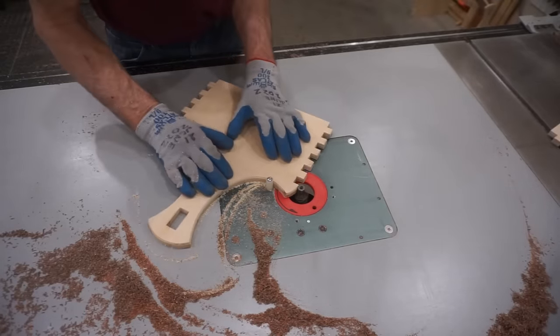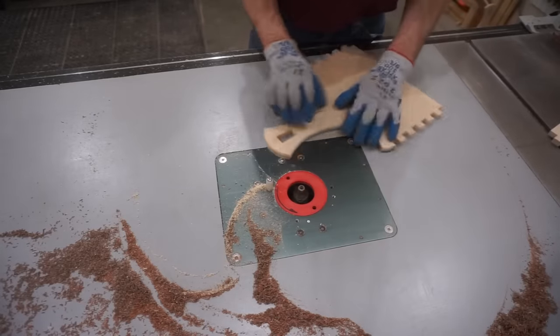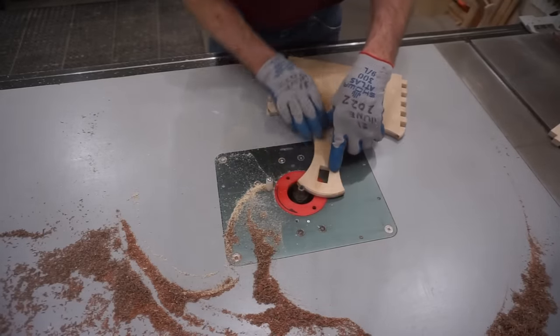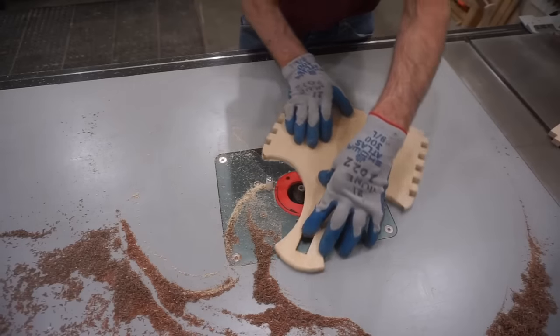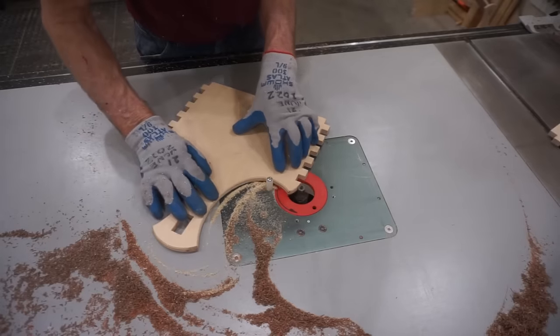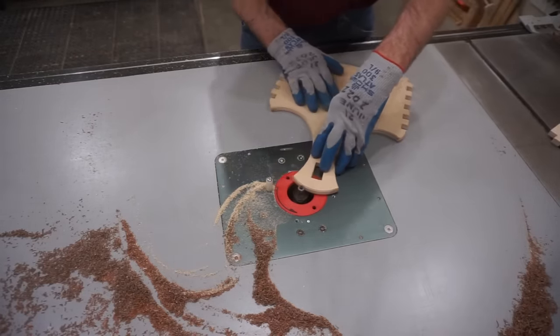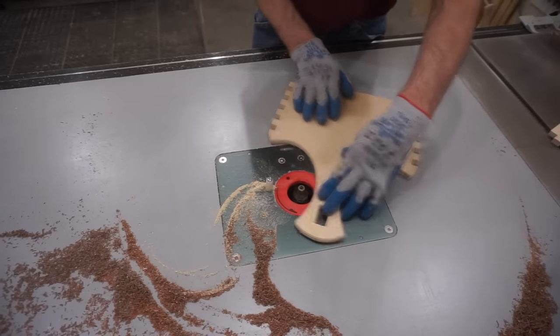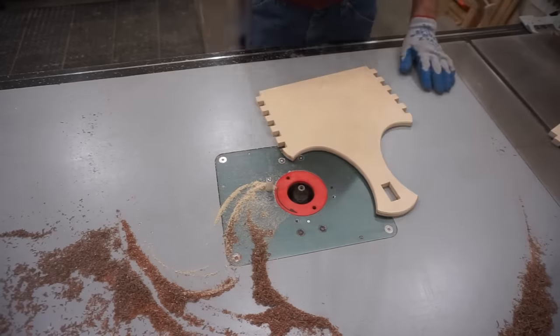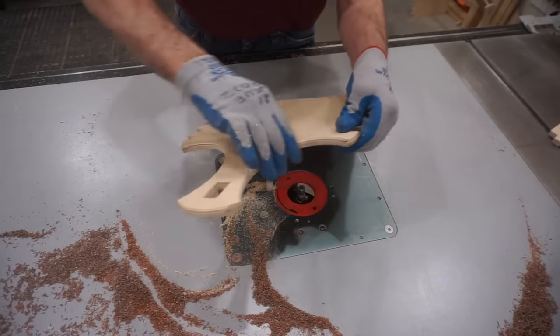You can see the huge benefit of a starter pin because it gives me complete control while starting the cut at exactly the right position on the top of the side piece, even though it's not needed when I finish up the profile at the opposite end, because I pull the workpiece safely away without damaging the next pin. As with the side pieces, I take three passes on the ends, doubling up on the side with the first pass so that the profile is symmetrical on the edges.